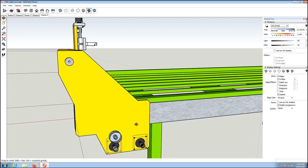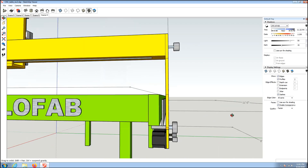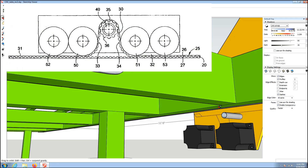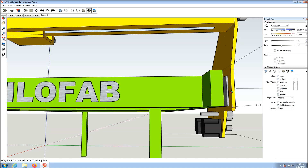The same applies for the long X-axis. For the X-axis, I can't get a ball screw long enough, so there will be a belt drive all the way across. The Y-axis motor is positioned down low to counterbalance the weight up top. The X-axis motor — with an identical one on the other side — goes through a jack shaft so I can change the ratio. That jack shaft connects to a timing belt on the bottom of the rail. The timing belt system has two pieces: one with teeth facing down and another facing up that interlocks. One is static, one is dynamic. Rollers keep the gantry on the table, and the bottom rollers act as a backup redundancy.